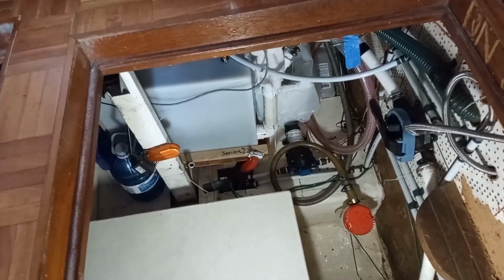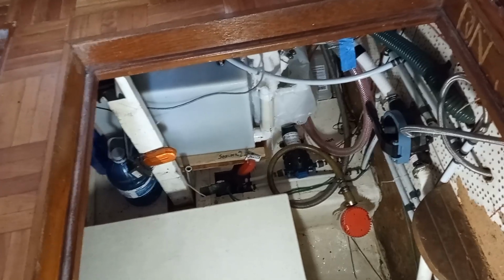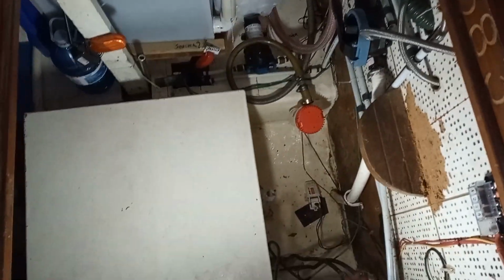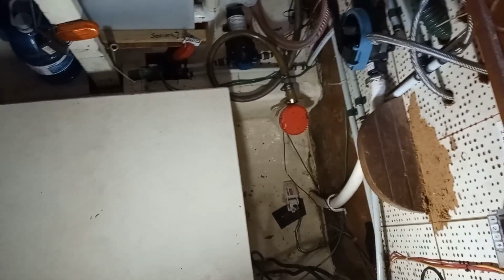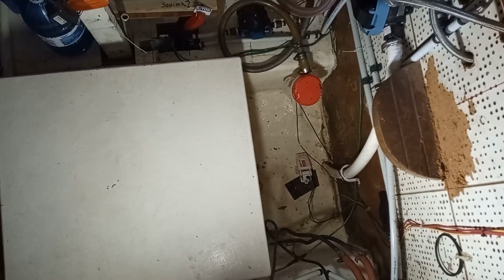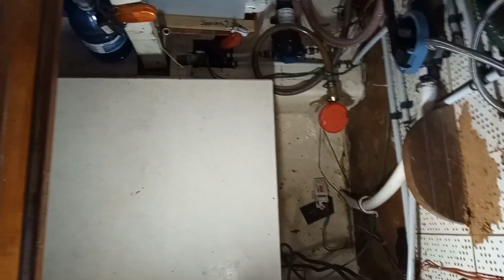And then I just stuffed all the hoses with rags and stuff and closed all the seacocks so bugs and stuff can't get in. As far as the bilge pumps, I've just brought them up above the water level. There's actually a low point drain down in here. So if we get water in, it'll get only to a certain point, then drain out the bottom. And then I've also left the engine seacock open, so I won't leave the bilge pumps, because I wanted to turn off our 12 volt power completely.